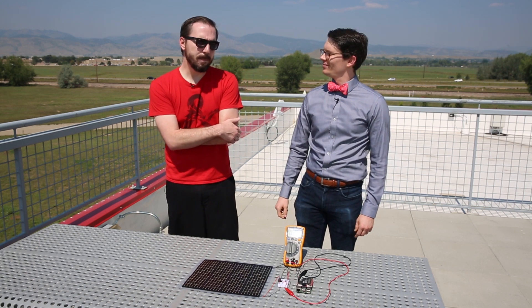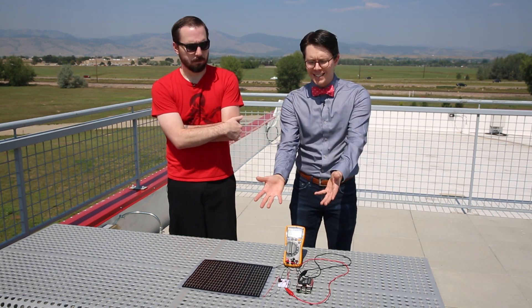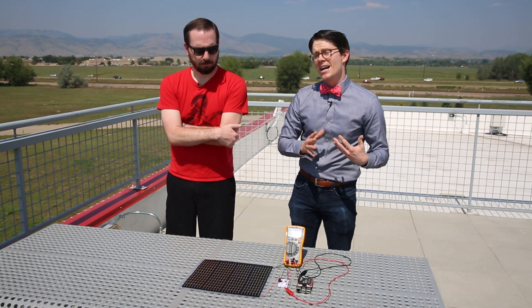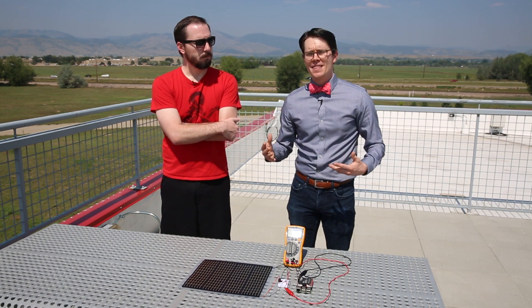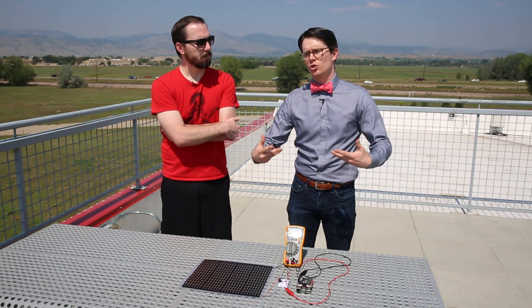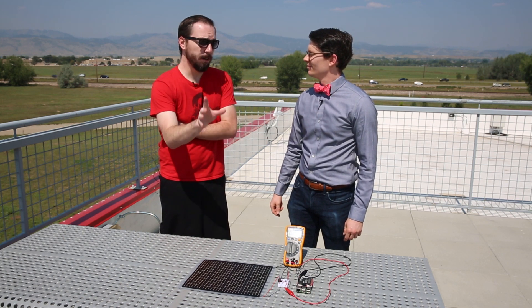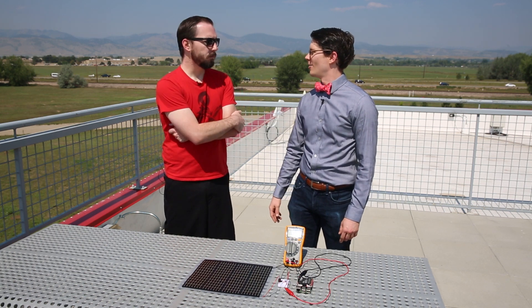So we are actually charging the battery. What does that mean for the Pi Juice and the PowerFilm solar cell set? They work well together. I will say that even this big cell is not enough to power a Pi on its own, so you need something like this in order to charge up a battery. That means you can turn on your Pi at regular intervals to collect data or post something to the internet, and then shut it down so you can store the energy again. But you can still very easily use one of the 5-packs or 10-packs of the PowerFilm panels with the Pi Juice, and I'm sure if you connected them up together, you could get a lot of power out of that.